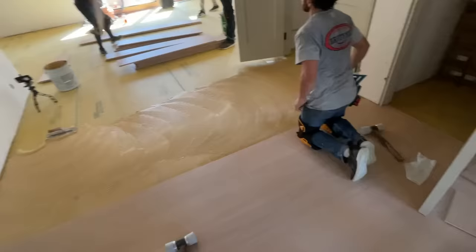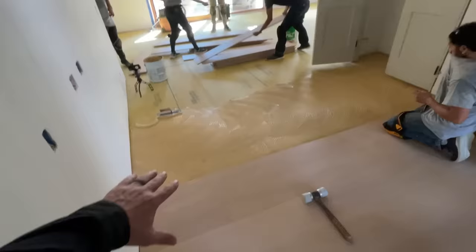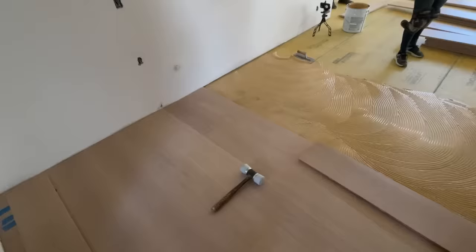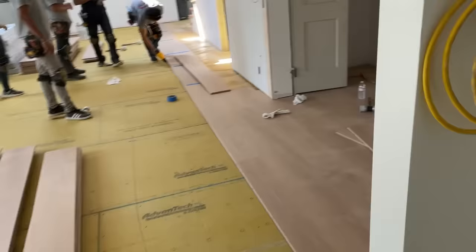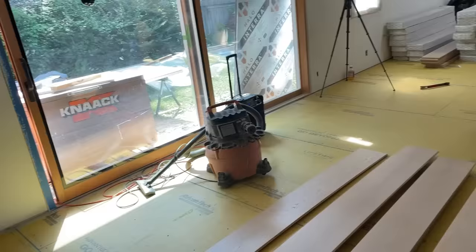Wilson and his crew are knocking out my entire house - about 2,200 to 2,300 square feet of hardwoods in two days. No need to come back to sand and finish, so I can bring in my cabinets and put base molding down without additional shoe molding to cover any gaps. Wilson is maintaining a gap between the wall and the floor for expansion. The house is about a quarter inch out of square, so they ran a string line, tweaked two boards, and will land at the door with a nice straight board.